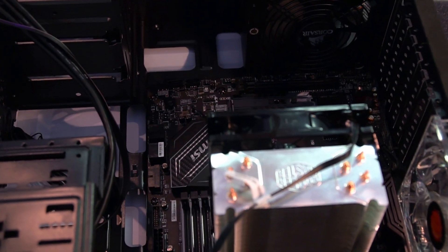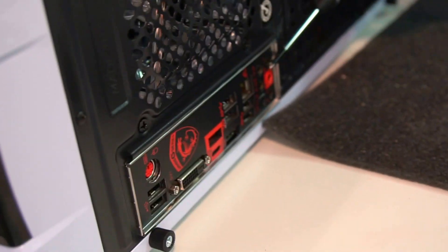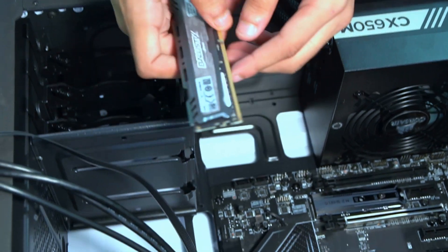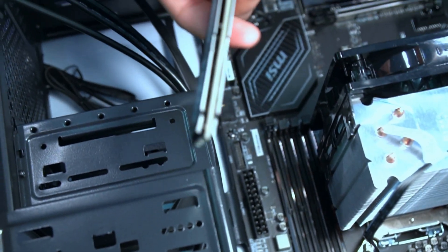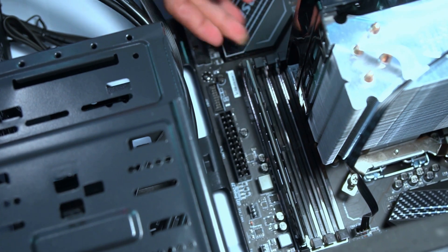As you can see, we brought the case back and went ahead and plopped the motherboard right in. It's really important to line up every single screw hole when you put it in. Make sure the I/O brace has all the holes in the proper outlets and is spaced properly. Then we take the standoff screws and screw the motherboard in. Now that we've got the motherboard secured, we're going to plug in the RAM. With our one stick of 8GB RAM, we push the slot clip open, take the RAM stick with the arrows pointing down, slip it in, and push down to clamp it in place.